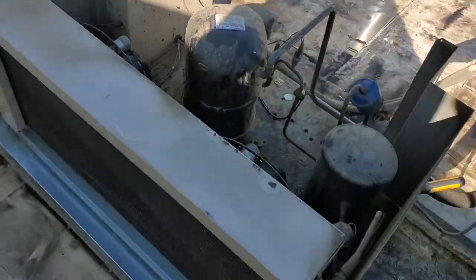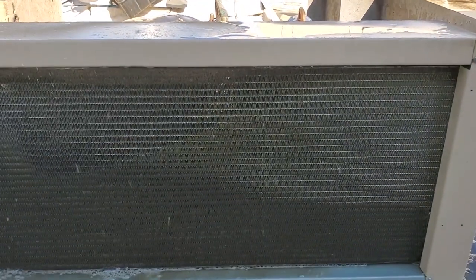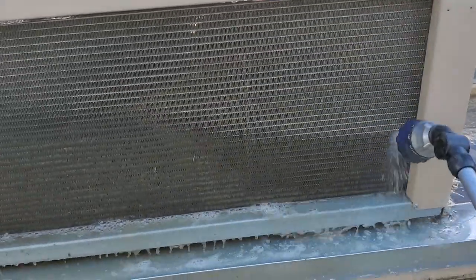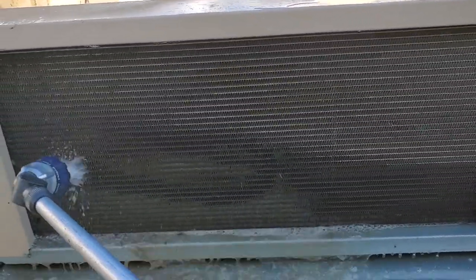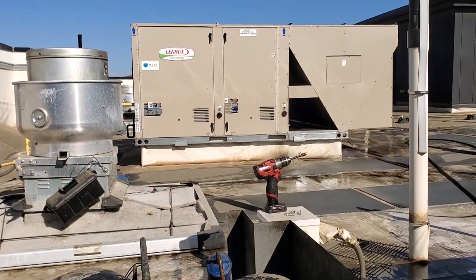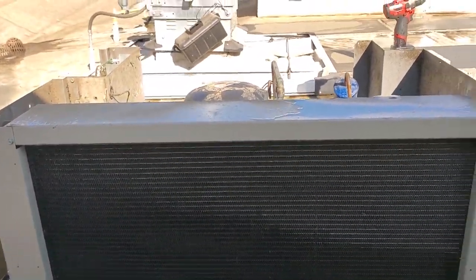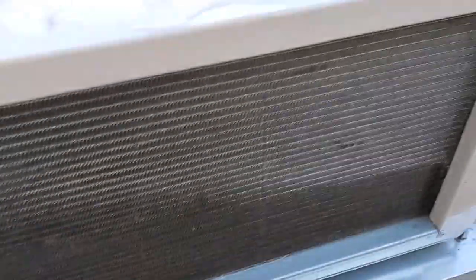I don't think I can clean it from the inside out without taking up the fan motor too, so we'll have to give it a good rinse from here. I want to be careful not to saturate the motors so they don't short out. It looks like it's coming pretty clean — it was just surface stuff. I'm going to recommend they have us come back and do a proper cleaning on the AC units because the inner coil is really dirty. Let's just get them by for now. I'll let this dry off for a second and then we'll start it up.